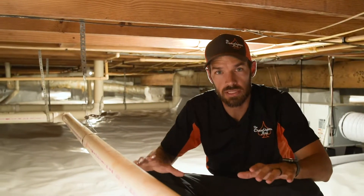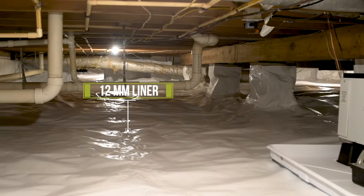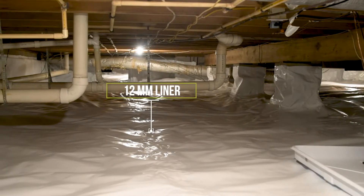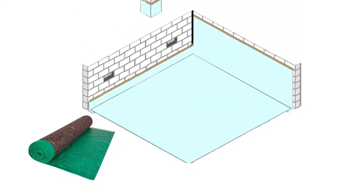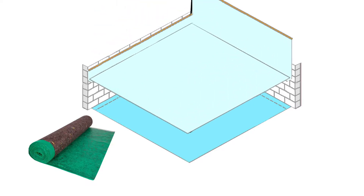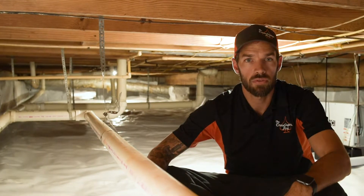...this is the most basic encapsulation I will do. This is a 12 mil liner that we put in here — it goes up the walls and on the floor, all 12 mil liner. We also put an underlayment under this liner, almost like a felt. What that does is it protects the liner in case there are any small rocks we didn't get out or anything like that, keeping them from poking through the liner.